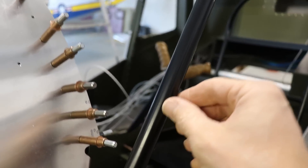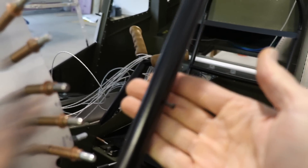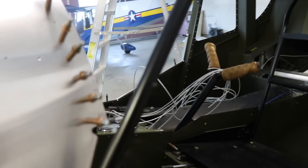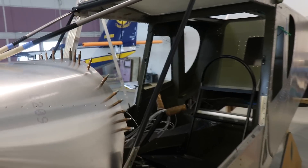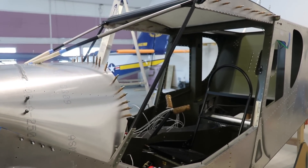Check this out — I have a 3mm screw tapped into the side here and it works perfect. These are the same black screws I'm using on the top and it actually fits really nicely in there. So that means I'm going to go ahead and tap all of those holes and instead of using the sheet metal screws I will use those nice black threaded 3mm screws.